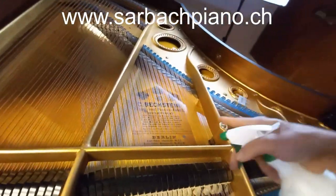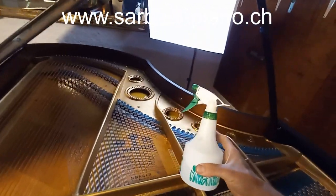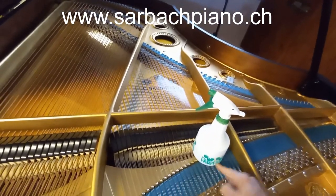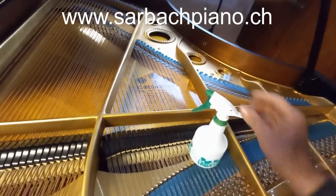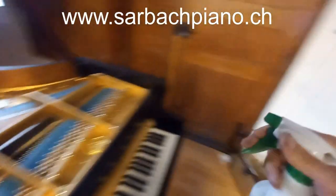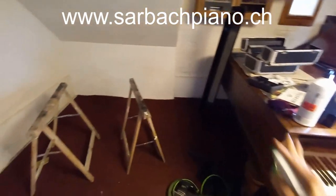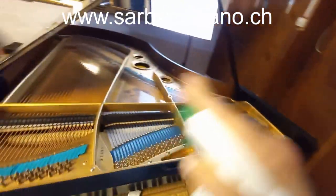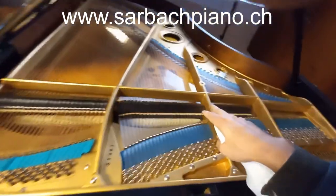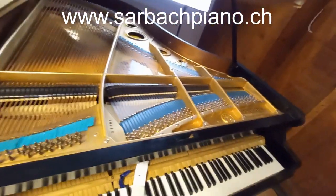This old lacquer is on a base of alcohol and it stays soluble. So what you can do is just take one of these, fill in here some alcohol, just normal. You can use this also to clean. And then you put here the soft installation, and then you can just like this put a little bit on the whole surface. Not too much, of course, really not too much, just a little bit. And then the whole surface will start to shine, and also the cracks that have appeared over the decades, these cracks, they just disappear, and it really looks very nice afterwards.